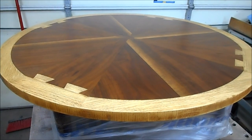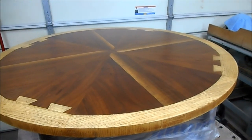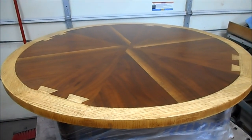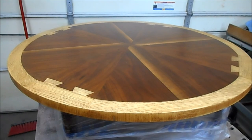Good morning. Got our second coat of sealer on last night, and when it dried, I got everything sanded down, and it's now ready for some color. As you know, I normally apply color to these Acclaim tables by using a spray-on toner that I make. I believe that they look best with a light coat of a medium walnut on them.